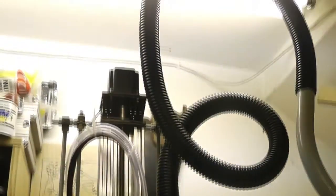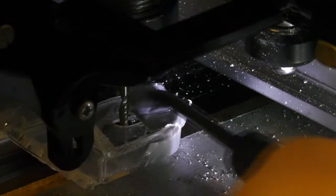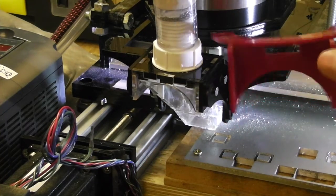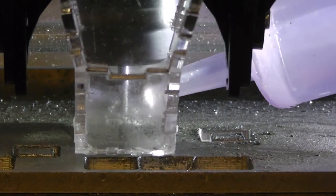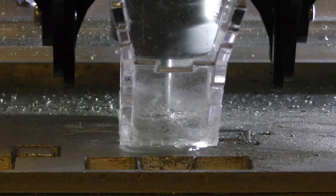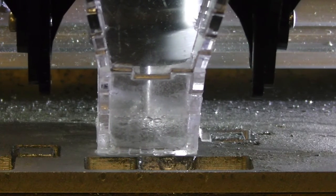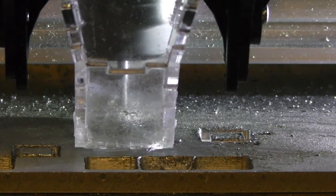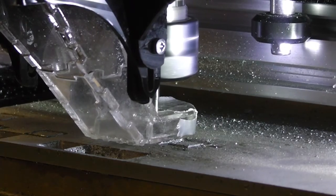Here's that assembly in place on the X carriage, linked up to the vacuum cleaner as before. These duct tape flaps cover up the slits in the design to increase the efficiency of the vacuum. The part that connects to the X axis is a direct replacement for the one that connected to the spindle carriage. I read that water is a perfectly good lubricant for aluminium cutting and I realised that WD-40 and quite a few other lubricants could actually damage the acrylic or melt the joints of the acrylic pieces. You saw me adding water directly there just using a syringe, but in future I hope to attach some sort of slow pump to gradually drip water onto the bits or into the cuts.